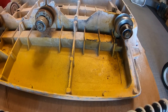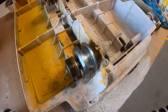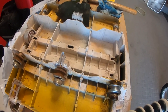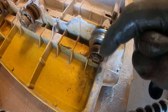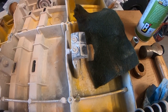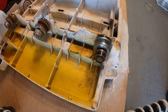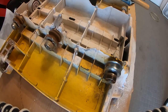Nice and straight, nice and tight, not moving around. If you're having problems with your trolley and need some wheels, definitely order yourself some bearings — it's worth having several on hand. Usually on a rebuild I need to replace one to two. You by no means need all 12. I would definitely have one of the outer cups as well — I know I'm replacing this one; he's got a groove worn in him. After this, it's usually cutting really well — easily a year or two of use depending on how much the saw gets used.